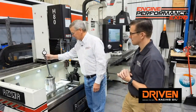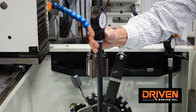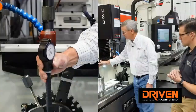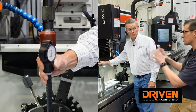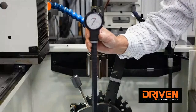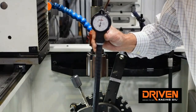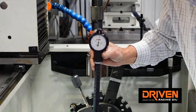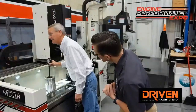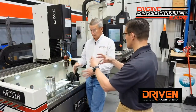Let's take a couple of readings here. We're going to go in and move this dial bore gauge relatively slowly so you can kind of see the needle peak — and we're right there at zero in the middle. This is a honed cylinder, so we know we've been working the best we can to get this thing as straight and as round as possible. We're zero at the bottom, and going roughly 90 degrees, we're pretty close to zero there — maybe a tenth high at the bottom. That's the cylinder in the fixture in the clamped state.